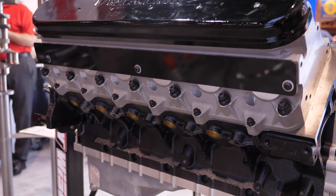So with the block options — cast iron and alloy — you've essentially incorporated LSX enhancements like the pinch bolts to give the best of both worlds. We try to bring all the good parts together — the best of everything that's proven. The cast iron block also makes some things easier, particularly no need to sleeve the cylinder bores. In the alloy block, we do sleeve the lifter bores as well. Some say you don't need to, but it's good practice — same as running studs, which gives more area on the block. We try to apply best practices from racing engines.